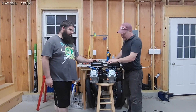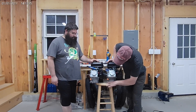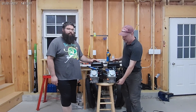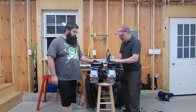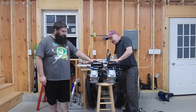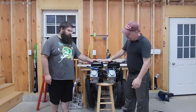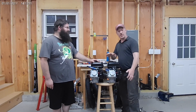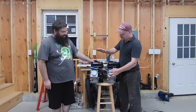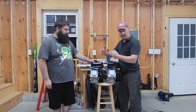So guys, we've got both engines now bolted and secured to this one mounting plate. The coupler is connected. There are no plugs in it right now — the engines turn nicely together. We've got both engines set at 180 degrees out from each other, so when this engine is on a compression stroke, this engine is on the exhaust stroke.